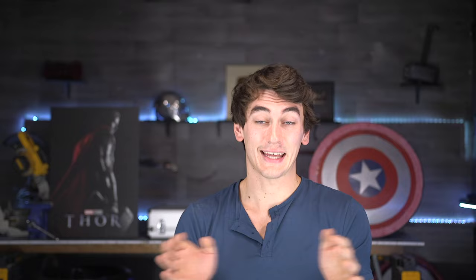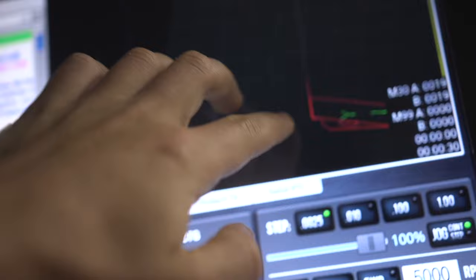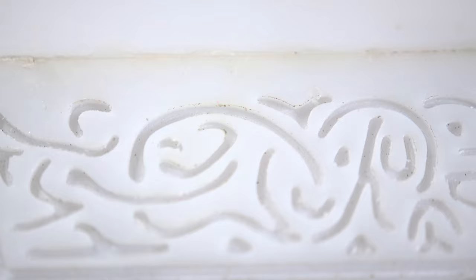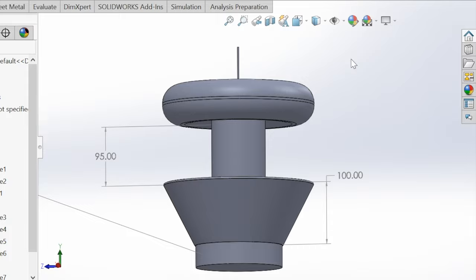I 3D modeled the entire hammer to fit around the coil, but we can't use any conductive material. I wanted it stronger than 3D printed plastic, so I got super high-strength polycarbonate sheets and milled them down to make all the parts using our new Tormach 770 CNC milling machine — this thing is going to take our projects even higher. After trial and error I got all the pieces cut out and screwed together. The plan was to have the wires run out through the handle to the driver on my back, but because we turned the coil sideways, all the wires had to run down past the coil itself.